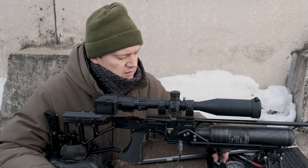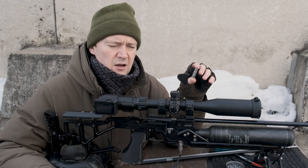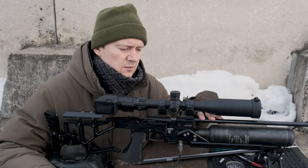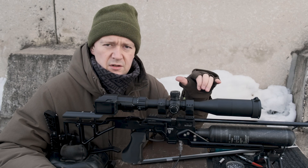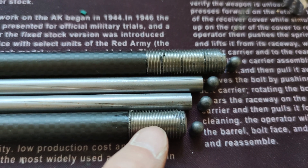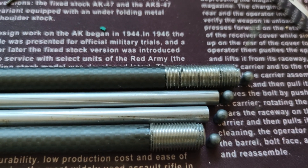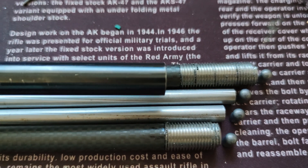Of course, I had to make some modifications. You can see that the original front fixation part of the liner is rather long and it doesn't allow me to fix the short liners. So I had to make another one and cut it almost twice — make it twice shorter. Then I had to make the barrel body also shorter by about 15-20 millimeters. And now it allows me to fix much shorter liners. I had to cut the front fixing part of the barrel and also cut the barrel body length to be able to fix the shortest liner I've made.